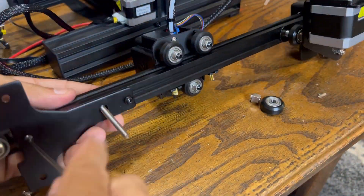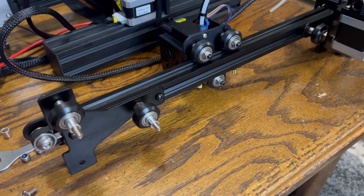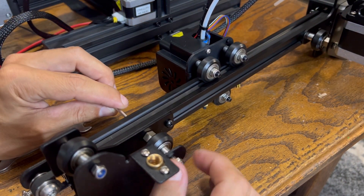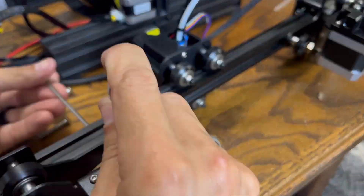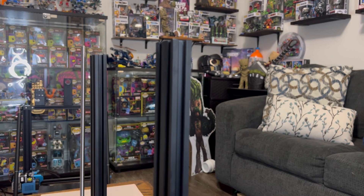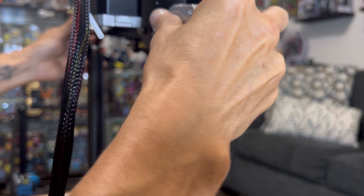Now grab the new hardware and do the complete opposite of what you just did, putting everything back in place on the X gantry. You can see here we're installing the spacers and the new bracket — go ahead and tighten that on and this will be ready to be reinstalled back onto the printer. Once everything is nice and tight, I actually like to loosen my Z rods and remove them before reinstalling the X gantry, as I find it a little bit easier. Trying to force it down with the Z rods on can cause binding — you could possibly bend the rod or cross-thread them.